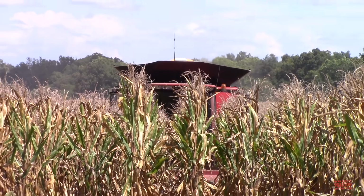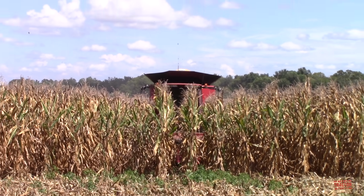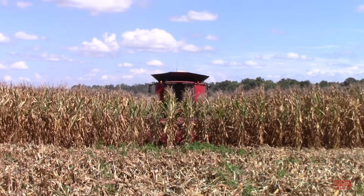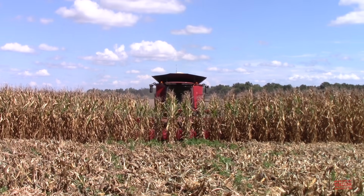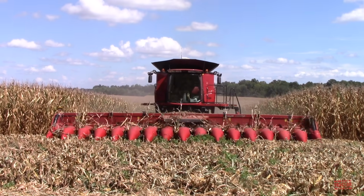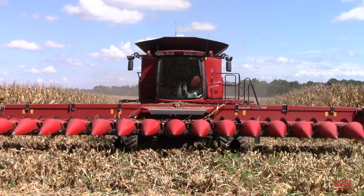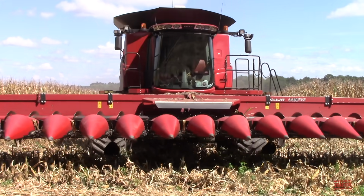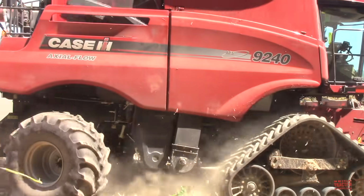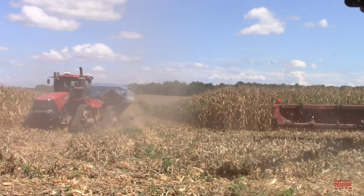This farm works to reduce compaction of its fields as much as possible by utilizing tracked tractors and combines, as well as utilizing 40-foot wide implements like the Kuhn Krause Gladiator strip till and the Case IH 2150 Early Riser planter. The farm further reduces that footprint by harvesting at 40 feet in the fall with Case IH 16-row corn heads, keeping the tracks of the heavy machinery in the same spot throughout the entire growing season.